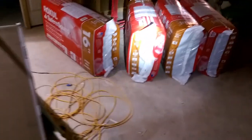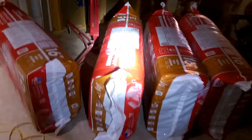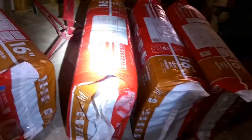And we've got our, I always called it rock wool, but I think mineral wool is the technical name. We use it instead of regular insulation for sound deadening. That's what we're going to put up on this wall here and this wall and wherever there's room for it. That'll cut down the noise if the washing machine's running in the utility room or the dryer or whatever. And of course the AC unit too, but it's pretty quiet.